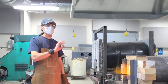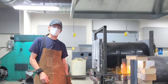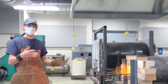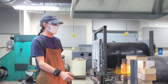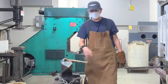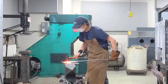I like to start something thin or at a point — something larger at the other end. Basically when working with decorative ironwork we're working with linear forms, like lines in a drawing. A line that varies in thickness is a little more interesting than lines all the same thickness. Now to form the handle I'm going to shape the steel over the round horn of this anvil. But first I'm going to quench the tip I just created because I don't want it to lose its shape.